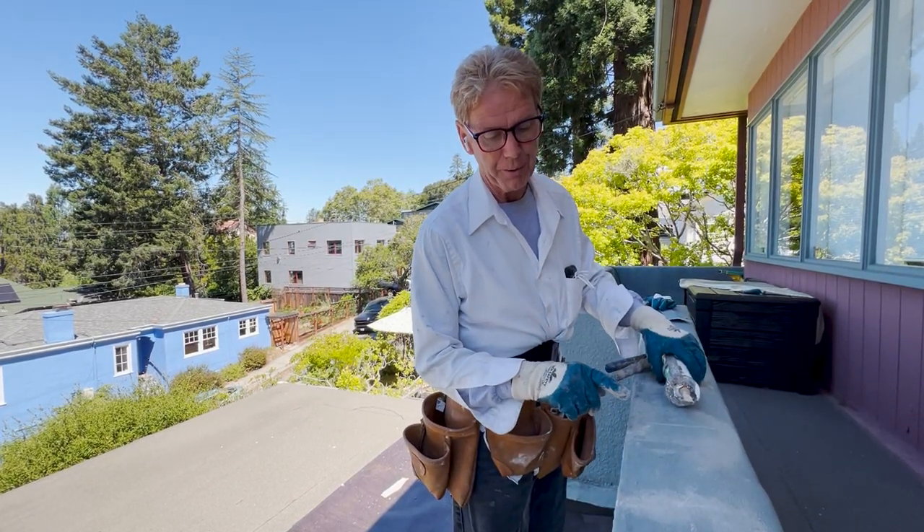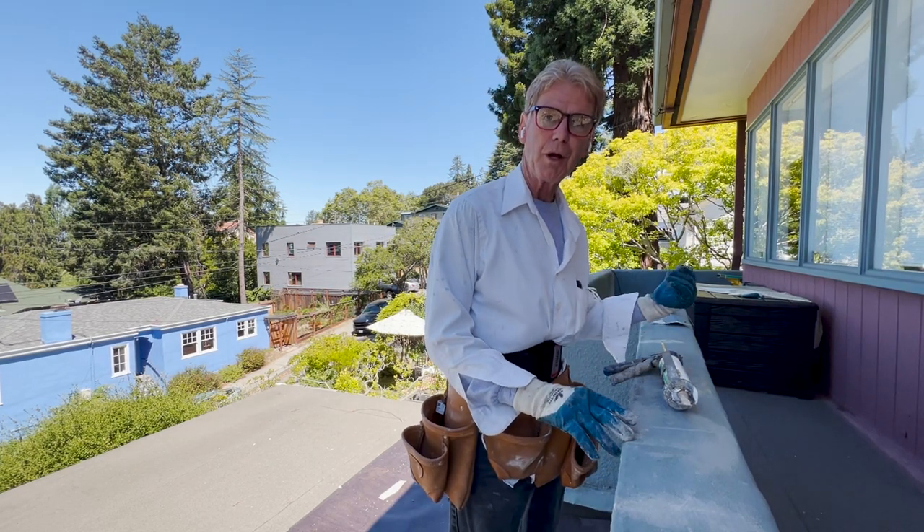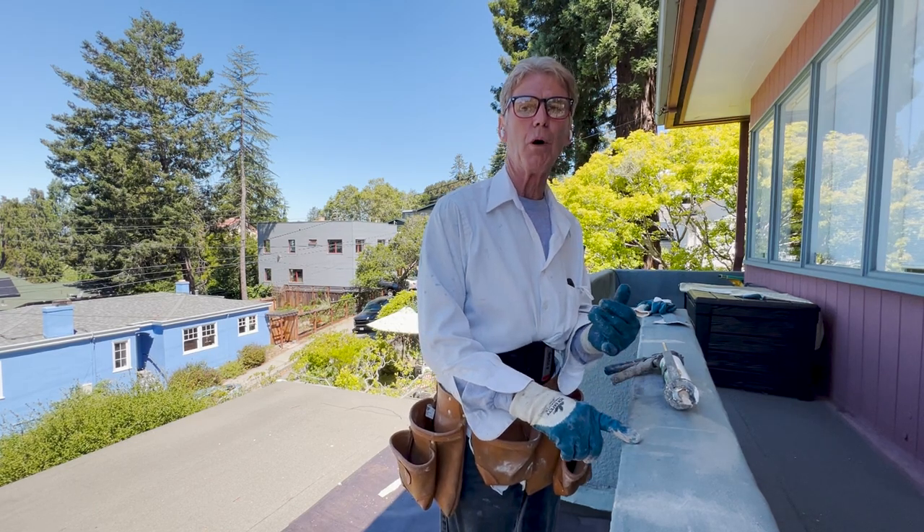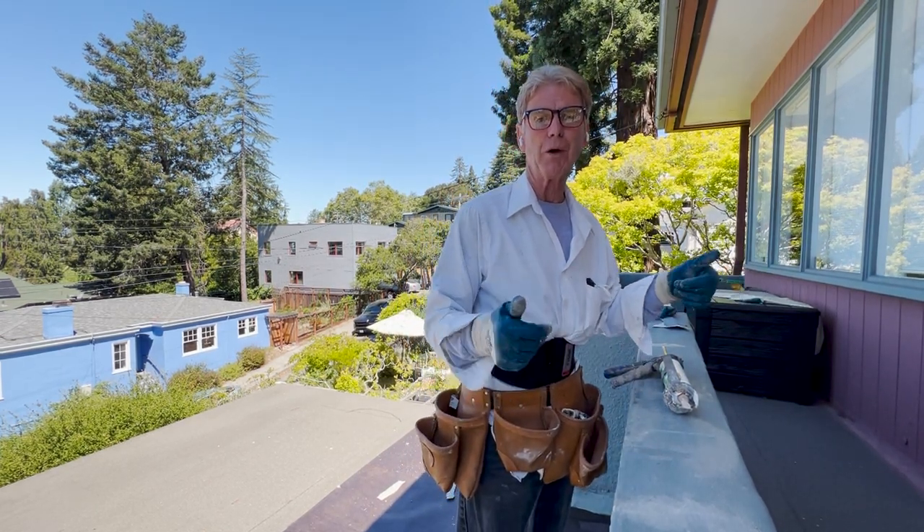This is all important — you'll never have to redo this. If you just keep all your cracks caulked, whether they're on parapets, window sills, or walls, keep them caulked and we won't have to go through this.